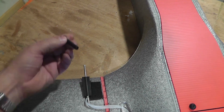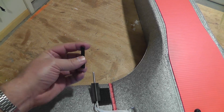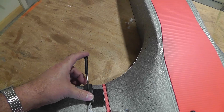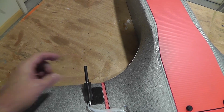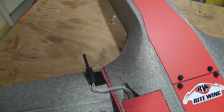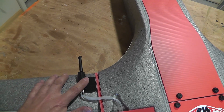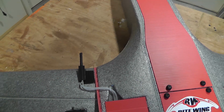I made this little sleeve. Those of you familiar with the Pixhawk system know that one of the things you often do before takeoff is a pre-flight calibration, and to do that you have to cover all the holes on your pitot tube. A sleeve like this just makes that process more convenient.